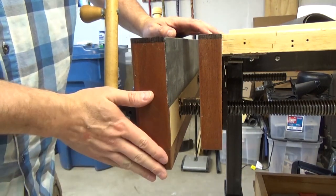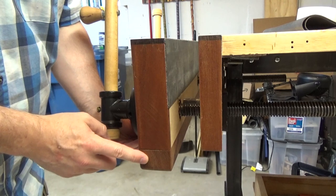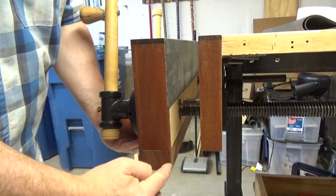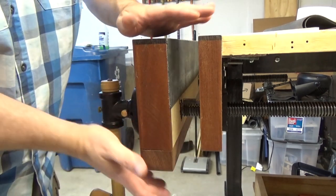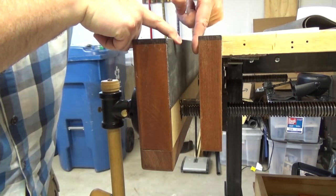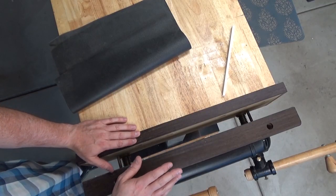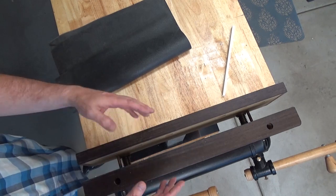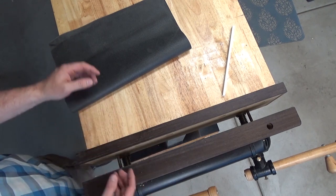One step in the instructions I didn't follow had to do with putting a 7-degree back bevel on the front jaw. The instructions indicated to temporarily affix a thin strip of wood to the front face of the vise and then run the piece through the thickness planer to create a back bevel on the front jaw. The purpose of the back bevel is so that when you close the jaw, the natural racking of the system will twist slightly, and with the back bevel the top of the jaw will still close first, then the bottom will pinch in later, creating a very strong grip. I didn't necessarily want to put the 7-degree back bevel on the front jaw because both jaws are made of mostly MDF clad with veneers of hardwood, and I didn't want to send this assembly through the thickness planer.